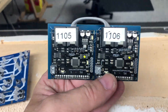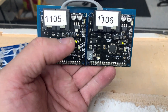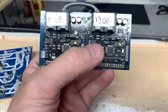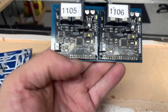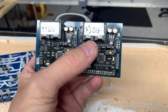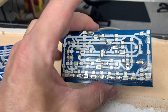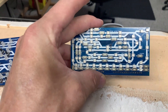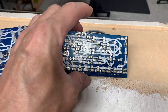This is a new version they're producing with black PCBs. You can either power them from five volts, or you can put these jumpers and end up powering them from the LocoNet connection. If your command station or standalone LocoNet power supply is able to handle it, it'll power this up.